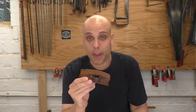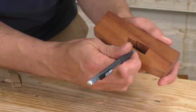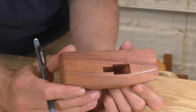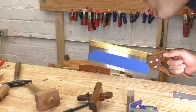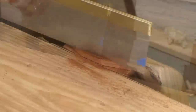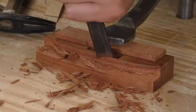Now I need to cut this curved rabbit — and that is no joke. Even the layout is tricky. But here's the secret: if you bend the last joint of your middle finger like this, the nail and the knuckle will give you two points of contact with the wood, and two points will follow a curve. Rest that finger against the edge, set your pencil to the edge of your mortise, lock your hand, and run that curve forward. When it's good, double check your distance and run the line back to the far end. This freehand technique is actually super accurate and it'll give you a great curve. I can rip down the rabbit's vertical wall with a tenon saw — I have tape on the blade for a depth gauge. It's really important not to go too deep, and I get the whole curve established before I saw down to my final depth. Getting the curved wall roughed out requires a series of straight cuts — I start with big chunks and my cuts get smaller as I get closer to my line. Then I pare down with a medium chisel using a diagonal slicing cut. It's slow and clean and minimizes the chance of any nasty splitting.